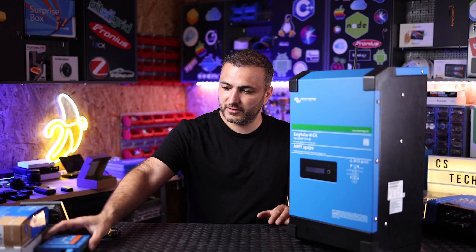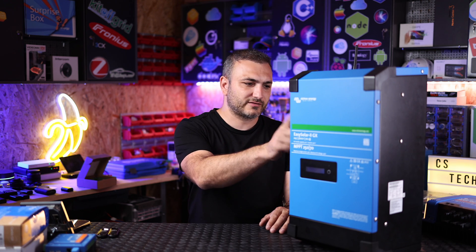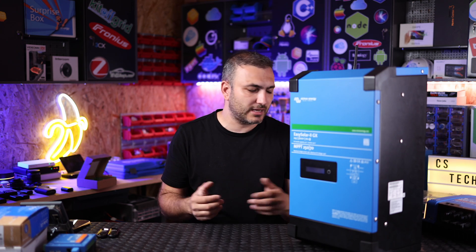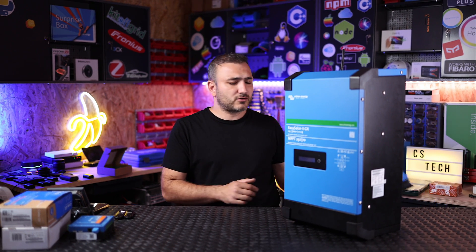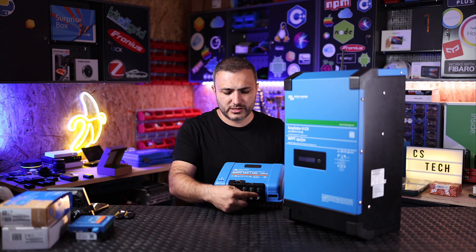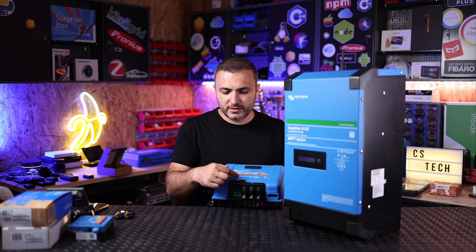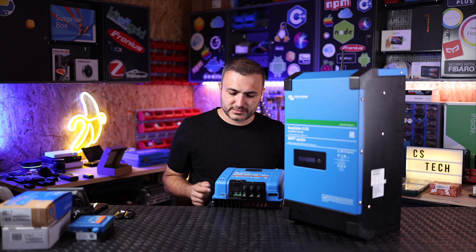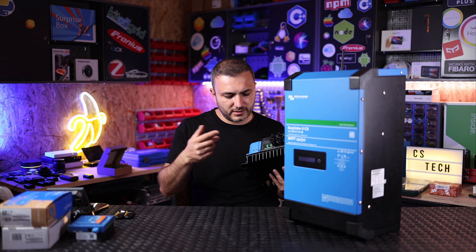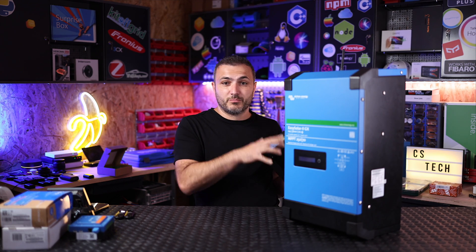So, we figured out this is the first unit already built in — the GX unit is already installed here. The second unit that is a component of the Victron system is an MPPT. Basically it's a DC converter. You can connect the solar modules here — as you can see I have an MPPT with an MC4 connection. You just need to connect the solar string here, and the output goes to the battery side. You have communication ports — two options: VE.Direct and VE.CAN — so basically the MPPT is already built in.